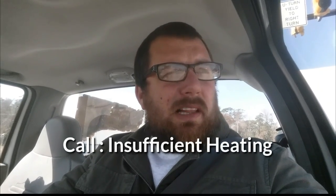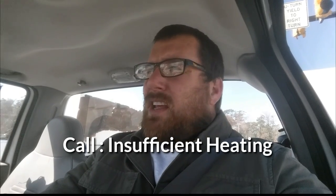Good morning guys, I am heading to a call for insufficient heat. We had a pretty low temperature last night, between 10 and 12 degrees depending on where you were. One of our customers' houses was about 50 degrees. It's a heat pump - he said the heat pump was running with no ice and no issues like that, so we're going to look toward heat strip failure because he doesn't think the aux heat is coming on.